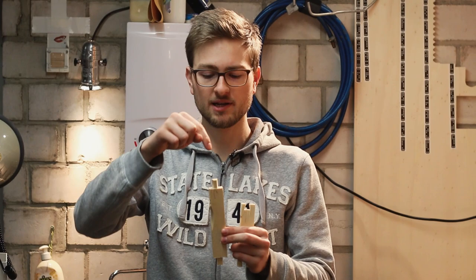I didn't have my Shaper workstation with me, but I still needed a way to fixate the legs in a way that I could mill on the top side. So I built a small jig that we used with a vise, and that allowed me to just mill on one side, flip the leg around, do the next one, take the next leg, and therefore I didn't have to change my grid alignment between cuts, but could just go directly into mass production and make all the individual bars for the complete laptop tray support structure.